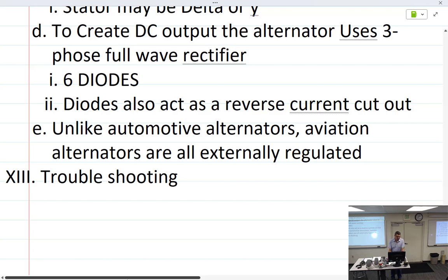All right, so you go up to the alternator and you've got 13.8 volts. What's your problem? It's good. It's not producing enough voltage. 13.8 volts, that's good, right? Battery's only good for about 13.2. So if you're picking up about 13.2 or 12 volts at the alternator, what are you reading? Just battery voltage. So a lot of people make that mistake.